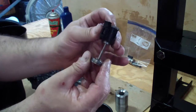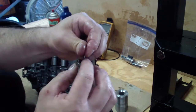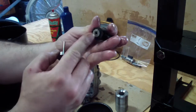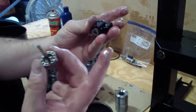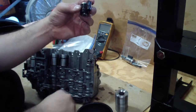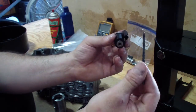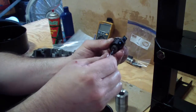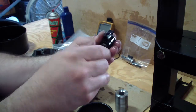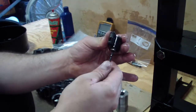It's a little sticky but this one is better than the other one. Yeah, it has that grit inside it. Same thing — I take the number 21 drill bit and go in reverse motion, so it doesn't start eating the Teflon until it's lined up with the other bushing.